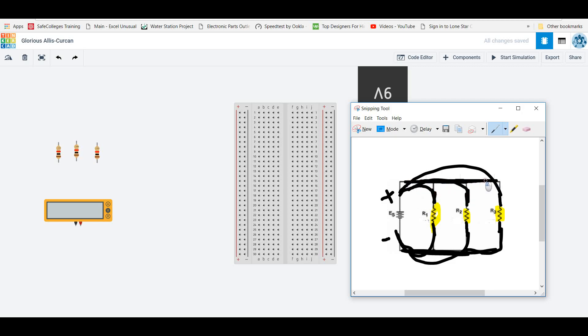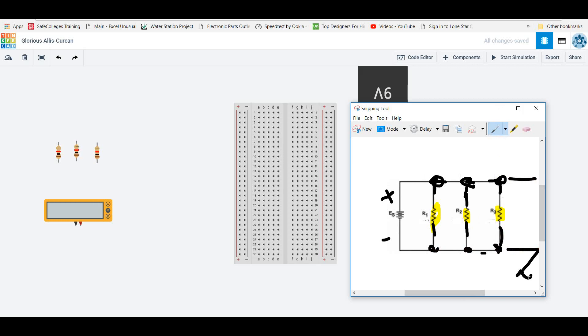When you see this bar along the entire top, that's telling you that all of these little ends of all of these resistors are all connected together into the same row. Same with the bottom — all of these little leads at the bottom are connected together at the same row. The easiest way to put resistors in parallel is just to choose two rows that are already all the way together with one another, and then just put those guys in two rows.